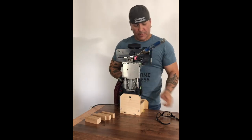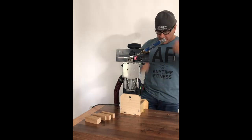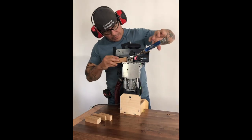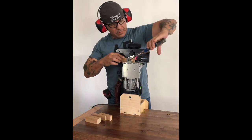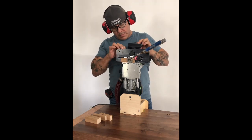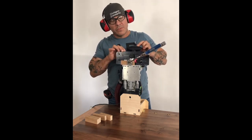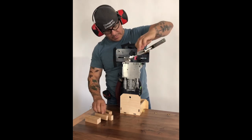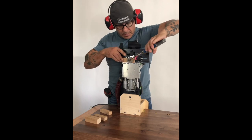The dock is a cradle. It's designed for the Festool Domino, either the DF500 or the XL700. What I have shown here is the XL700. You can see these small pieces of wood. These would be challenging to hold down, clamp, and route mortises in, but with the dock, we can put the Festool Domino in an upright configuration like I have here.